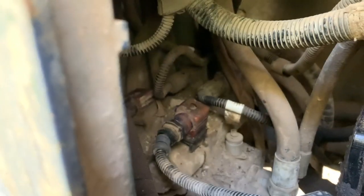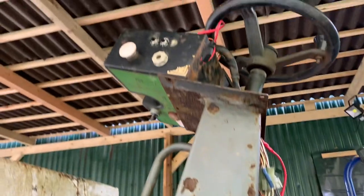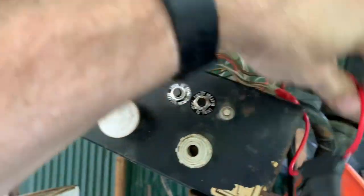They don't control - they don't enable and disable the flow as far as I know. There's one, two, I can't see three but it's there somewhere in the mud and muck. In fact that is it there in the middle of the screen - very dark in there. That's the fourth one. A while back we had issues - that one there has got a little bit of plastic cracked on the top, and water ingress there meant the fuses were popping. I've now replaced all those fuses with proper ones - about eight pounds each.